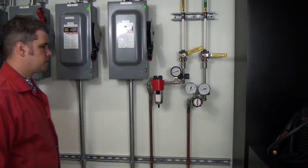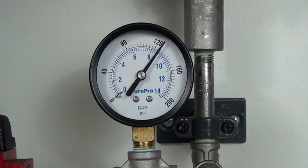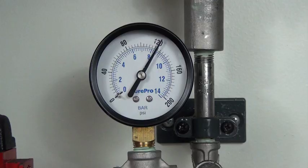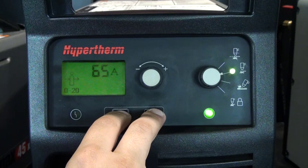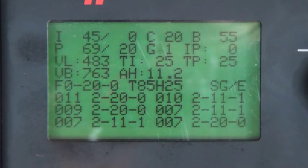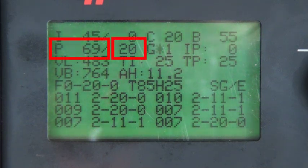Like the 012 fault, start by checking the pressure gauge setting at the gas source while gas is flowing dynamically. If input pressure from the gas source is correct, the output gas pressure can be located in the service screen. Set and actual pressure values are highlighted in red.